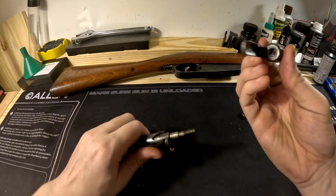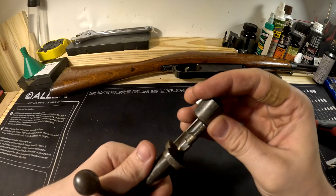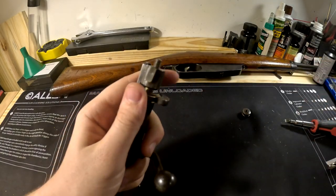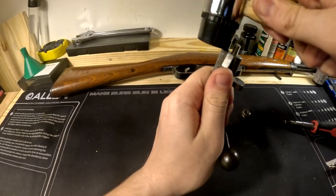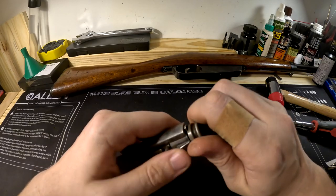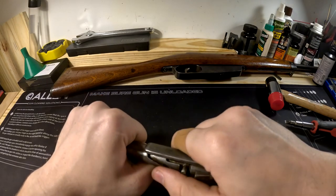Your cocking piece has a small relief and there's a corresponding part in here, so it should line up. Because this one is so tight you'll see there's a gap — normally it would just seat normally — so give it a few generous taps. Then seat it the rest of the way using the rear cap: spin it on. As long as it's flush, you're good to go.